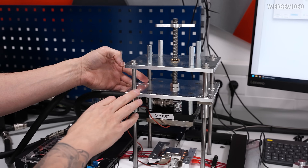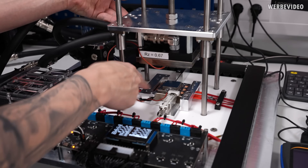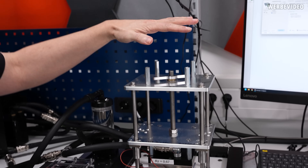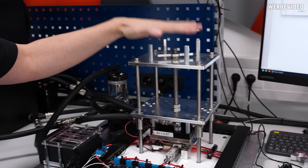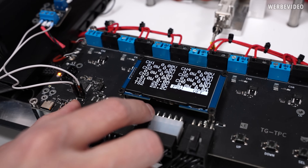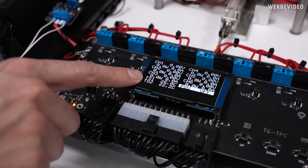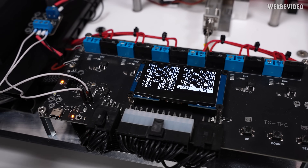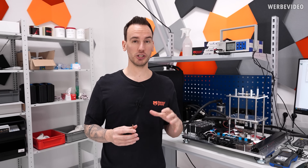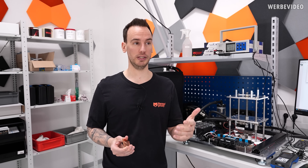The way it works: we lower the entire unit on top, apply the thermal paste on the dummy heater on the bottom — or a thermal pad for example — then this is lowered down and a second unit is mounted on top applying a defined downward pressure. The control unit on the bottom has six channels from the heating elements, where we can control the heat of each individual channel. These temperature sensors are also important when we want to do temperature cycling tests, which are very important for any thermal interface material to see how it performs long term.